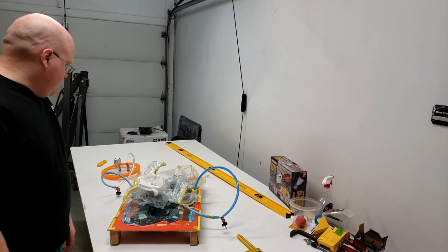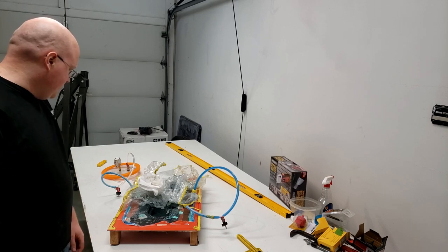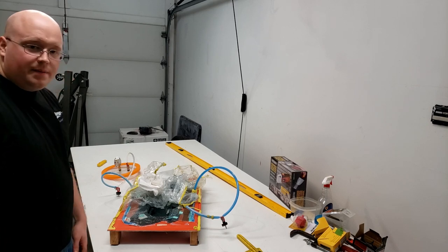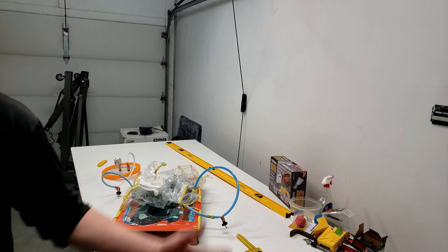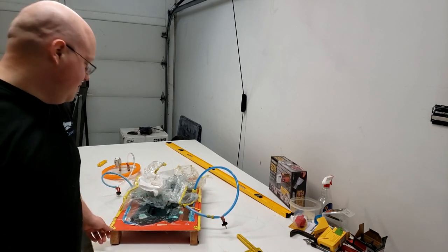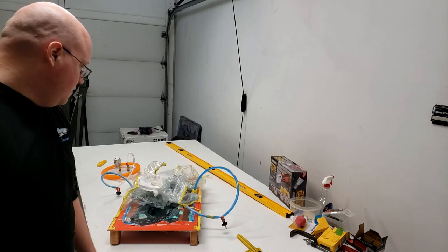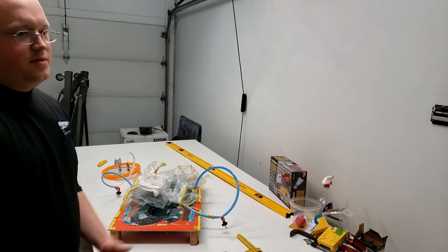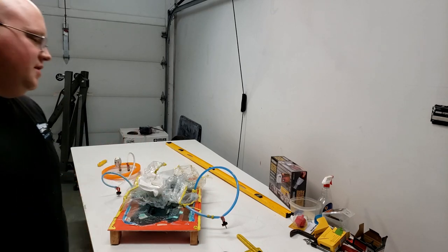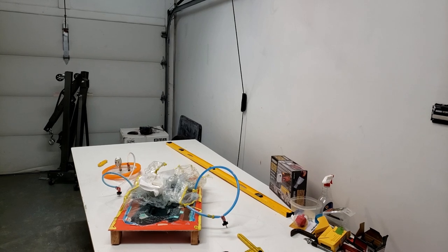I'm gonna go ahead and pull the rest of this off, and then get the board cleaned up, and we'll try to pop the piece out. So it is what it is. I put the general purpose hardener in it, so it doesn't have the high temperature resin or high temperature hardener. The bottles were sitting beside each other. I grabbed the wrong one, and here we are. So, lesson learned, we'll do that again.